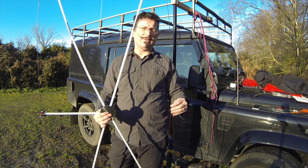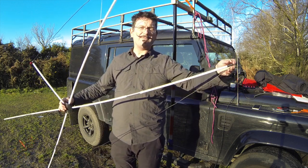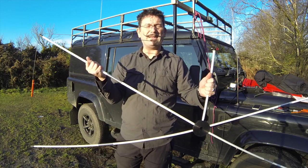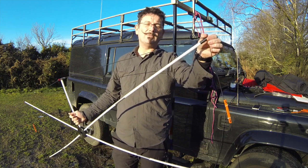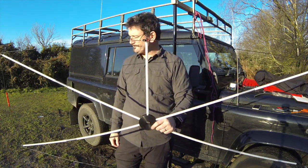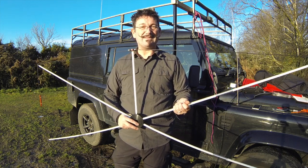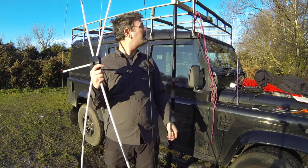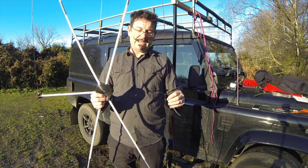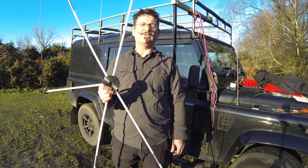That is the beast - very quick to make, very quick to put together. When you put it together it takes a little bit of fiddling to get the cable in the right place so you've got the right distance between each part and no big bends on the spreaders. I might see if I can find a way of marking those or putting some zip ties around them to keep them in about the right place and speed up construction. It's December - a lovely sunny day - but VHF isn't particularly fantastic. I'm going to give it a go today on my little mast on the Land Rover, and then we'll be using this in the RSGB UK Activity Contest starting in January.